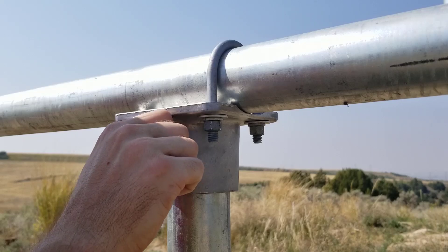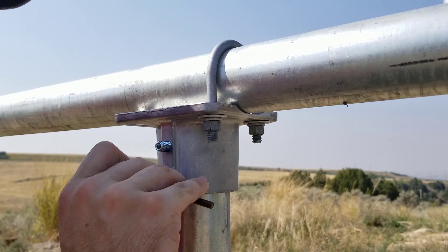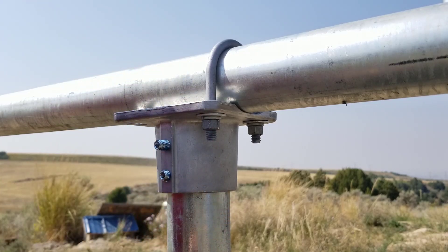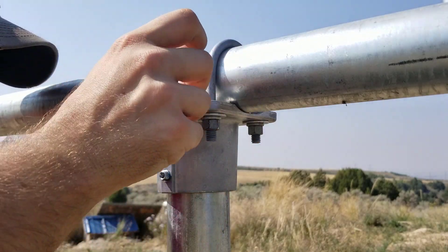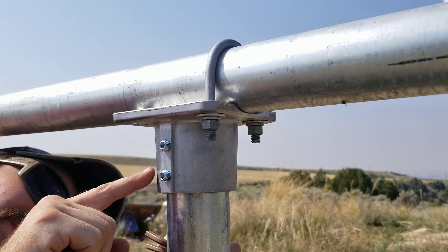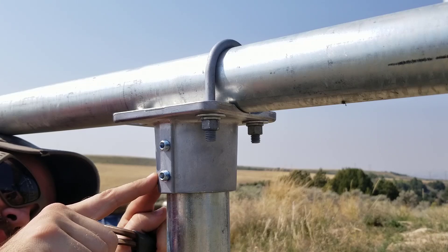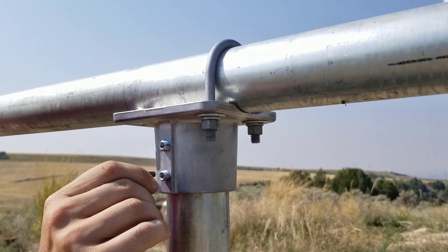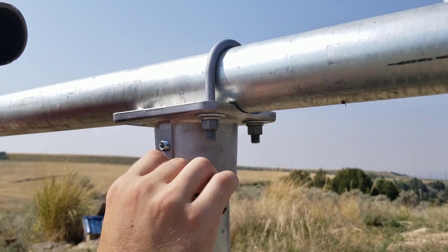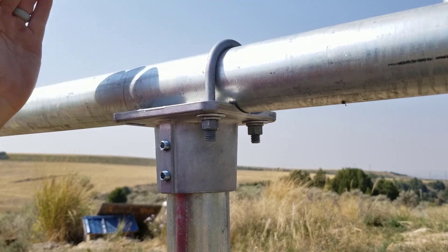At the top of the post we've got our cap, and then the U-bolt goes right over it. I just tightened this — it's a 9/16 nut — and it's going to take a 3/16 Allen wrench. These little bolts already have Loctite on them, and this is all we need to get them nice and secure. I don't have a calibrated torque wrench with me, but the Loctite is in and it's pretty snug. Now I'll put the other U-bolt on, get the top rail done with these caps, and start mounting the rails.